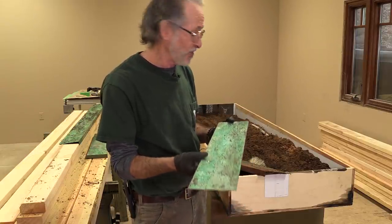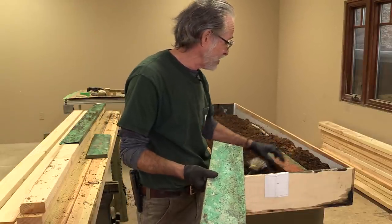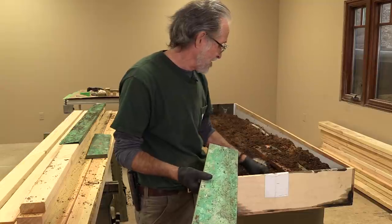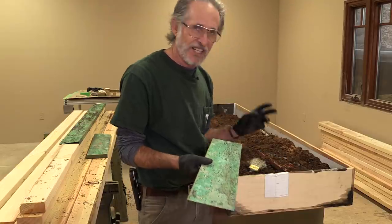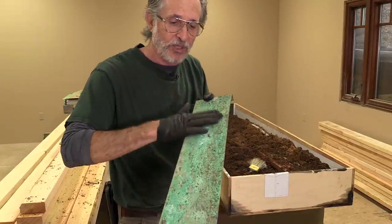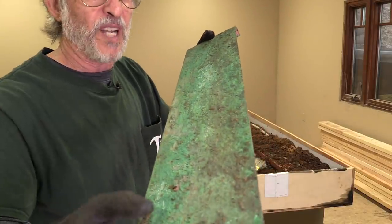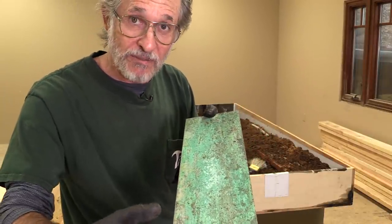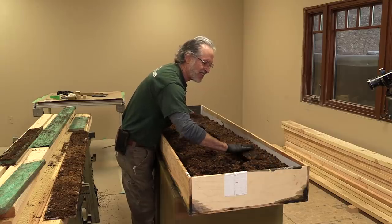It really needs to be out closer to the air. So I'm going to slowly pick these pieces out and leave them with just a little bit of sawdust on top of them, because the sawdust is saturated in the solution. That muriatic acid, salt, and water solution will keep the tops of these kind of damp, and we'll build up a really thick crust of patina with real flaking in it — that's what I'm after. I want there to be real thick flakes of patina on here. Then I'll shellac all of these before I spray them with varnish, and that'll protect the flaking from peeling off.